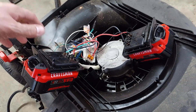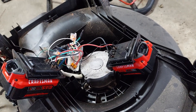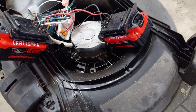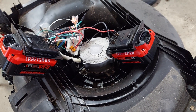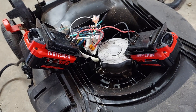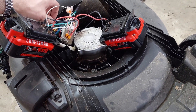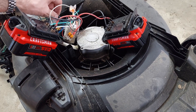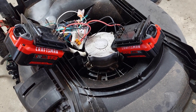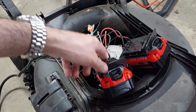I'm not going to be using it as a lawnmower. If you need the plastic housing, let me know — I have two of these lawnmowers and both of them work. Both had the exact same issue where the connectors were burned up. I'll attach XT60 connectors; I might do a video on that later. I'm taking an engineering class and hopefully I'll get to use the motor in something other than a lawnmower.